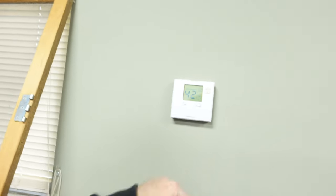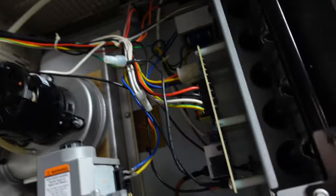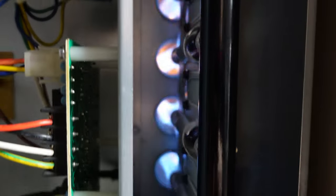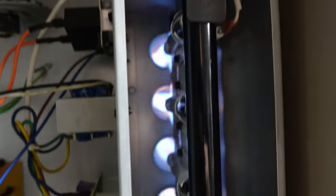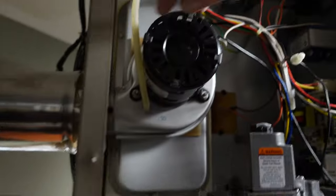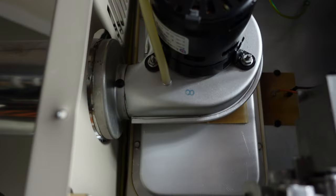So we're going to fire it back up. We heard the fan kick on — let's see if it clicks and heats. That's the sound you want. There she is folks — yes sir. The fan will kick in and get this circulating. That's all it is. Again, this rubber hose is a pressure switch up there. Something gets gummed up in this little valve — pull that air hose off, clear out that little valve, put it back together, and she should fire right up for you. Then just put her back together.